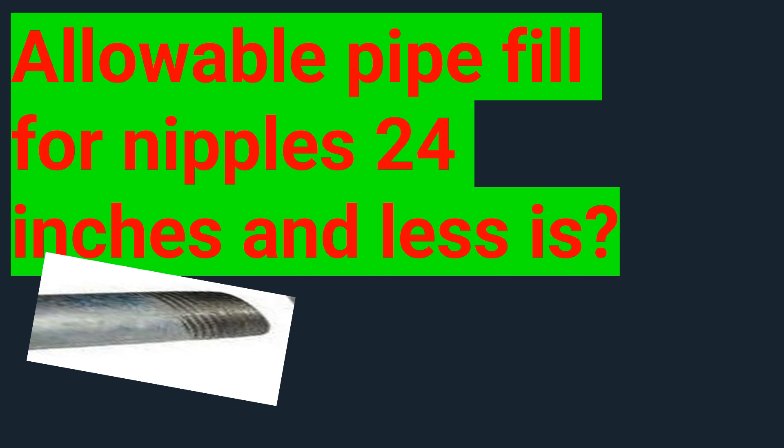I have videos and lessons teaching you all about pipe fill, but today we're talking about nipple sizing. So let's do half-inch pipe at 60% fill — that gives us the available fill volume in approximate square inches of that pipe. Now that we know the approximate area, how do we figure out per conductor? We flip over to Chapter 9, Table 5 — conductor properties. We locate our insulation type and conductor size, then find the approximate area of each conductor in the second part of that table.